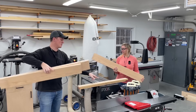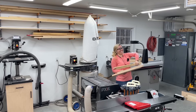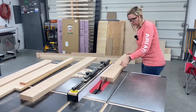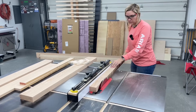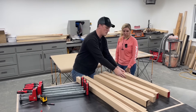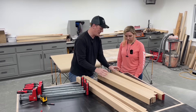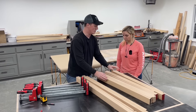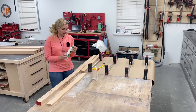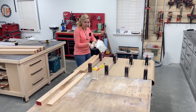Let's go ahead and rip these wider pieces down to match the others, and then we'll get them glued together. We've got our four table legs — they just need to be glued together. To conserve clamps we're going to glue them all at once. You want to make sure you're only gluing that piece to that piece, so you're not accidentally gluing all the legs together. We also have our four bench legs, two on each side still together.